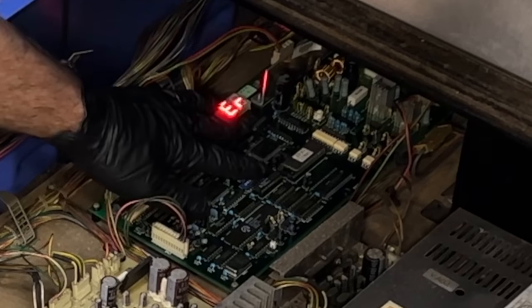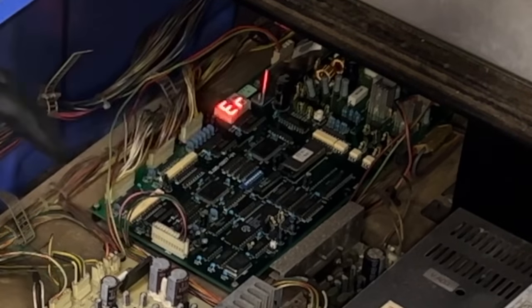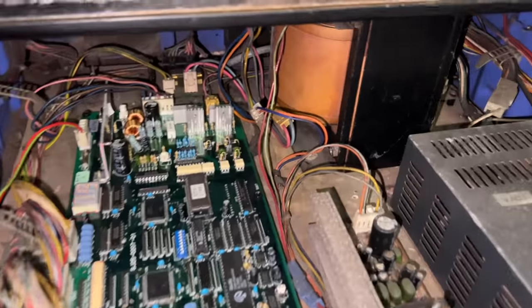This is the steering driver board. This whole thing here is just to run the force feedback. Way back in here, this orange connector here is supposed to have 100 volts connected to it. It's only got 5 volts. There's a fuse here. I hope that's causing the issue.